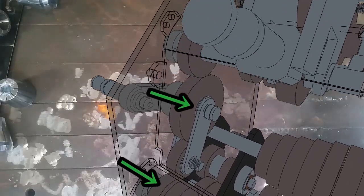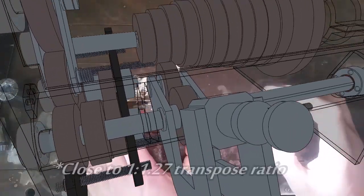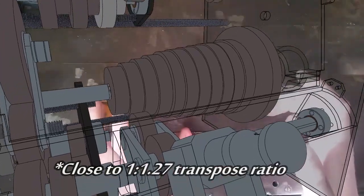From here it's onto the transposed assembly. This allows for metric/imperial thread selection. I've got a clever arrangement of several compound gears to get a very close approximation — that will be in the next video. From here there's another selector onto the screw gear stack. This is the final component of the gear train, for fine adjustment and thread pitch selection.